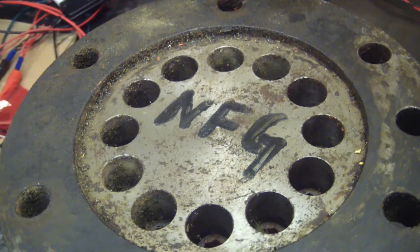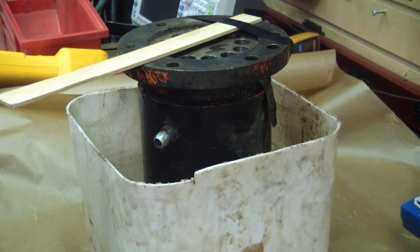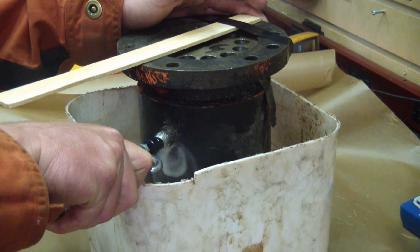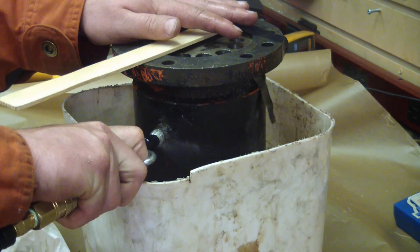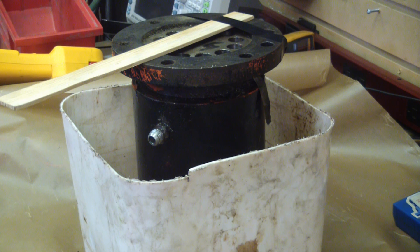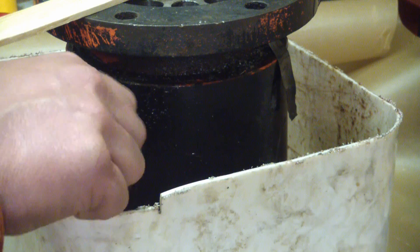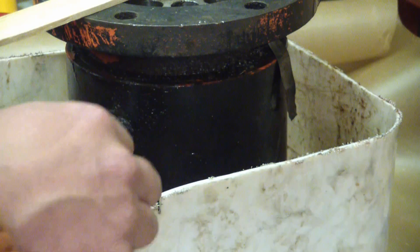We're going to find out. I'll get the work bench cleaned up so we're not contaminating the internals, and we'll have a look. Before I take it apart, I'll show you what it does. Essentially, it's a pivot — it replaces a pin and a big long cylinder with this very compact unit. It's a torque motor, essentially. I scrounged around in the bin and found a dash-6 to dash-4 JIC adapter, as well as an F-to-F dash-4 JIC adapter, thereby increasing the chooch factor to the necessary level.